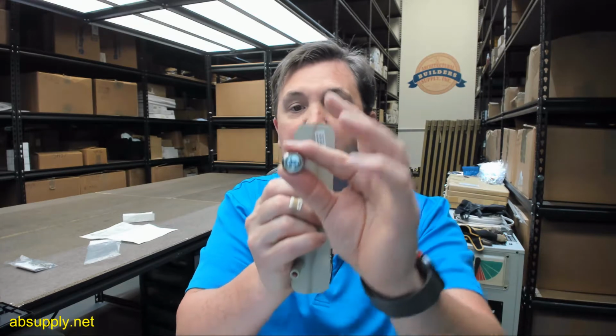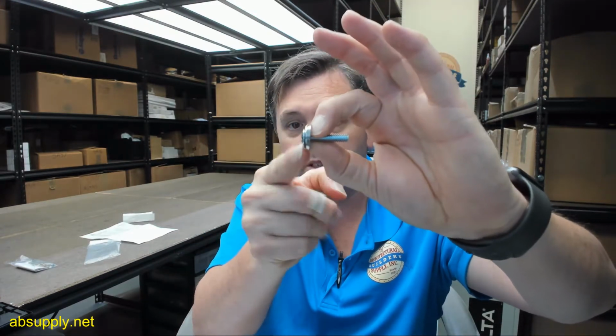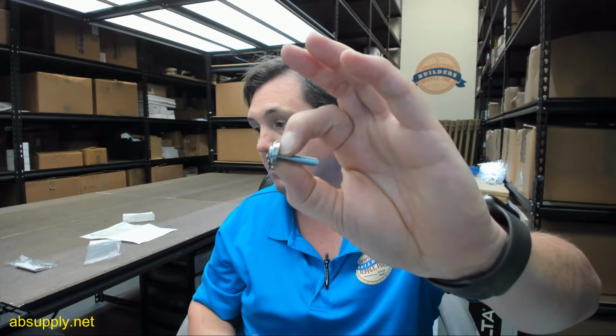And then, of course, finish off your installation. But you do want to make sure, again, before you install this material onto the door and frame, that this will not make contact with the face of the stop when the door closes. You want to be sure to have that clearance. If you're not going to have that clearance, you'll need either different fasteners or maybe a different latch protector by another company who makes a head of a bolt much shorter in projection than this, which can be accommodated. So be mindful of that.